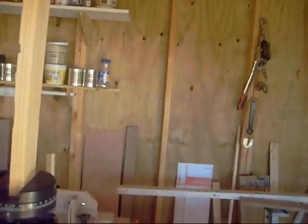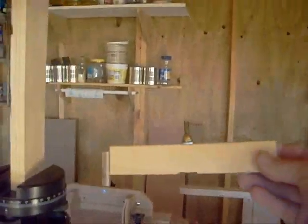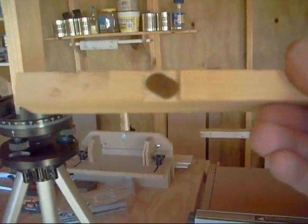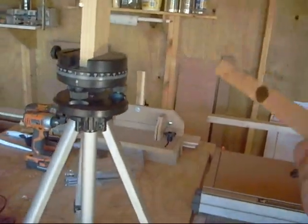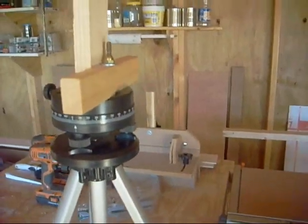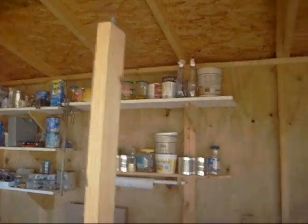Now, underneath the camera, you can see this. This is just a short piece of pine, and in the bottom here I cut a little dado, and this is a closet bolt that you use for your common toilet to bolt it to the floor flange. 1/4-20 threads again. But it worked. That's what I did all my videos so far on. With this sitting in there like that, camera mounted on the top, I just shortened the legs to get whatever I had to get. Well, I'm just going to build a little knuckle joint up there, and we'll see how that works.